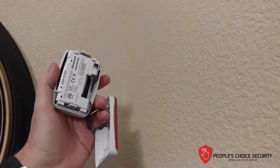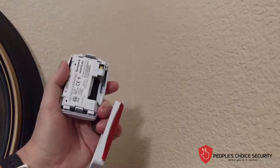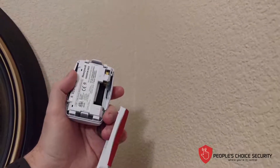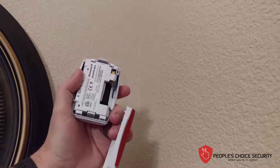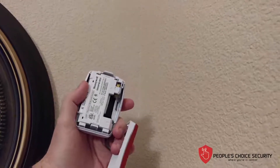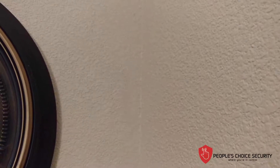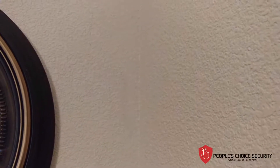Install our motion detector. It is important that when this backing is off, try to be in programming mode on the keypad. So I've left it in programming. If you don't, it will cause a trouble — your keypad will beep at you. So while I'm entering and putting the battery in, I make sure I have polarity correct, and then I go ahead and connect this up.